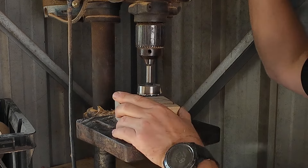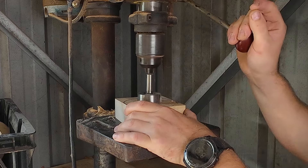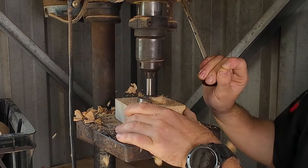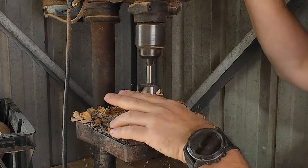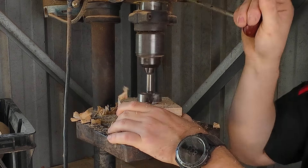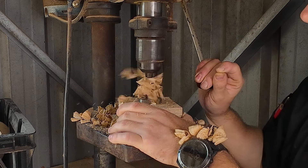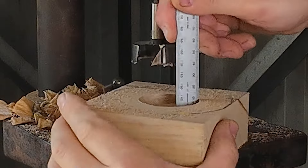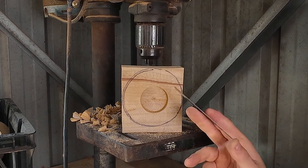Be super vigilant and make sure you haven't got any cracks running down into the blank because they can and will break apart and send pieces hurling everywhere. So let's go ahead and drill some of these mortises - just identify where that marker is straight down and there's one. Identify where that little hole is, make sure it's center, and there's two. The depth I've gone down is 10mm for that little mortise.